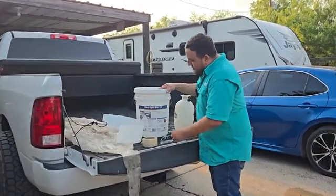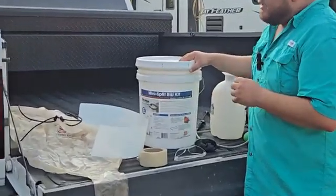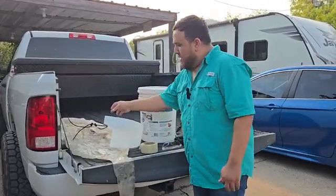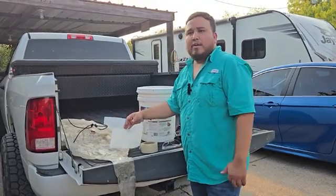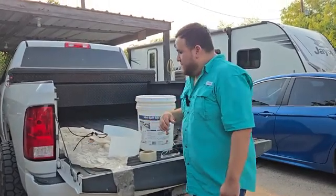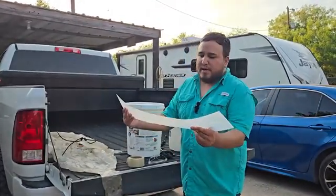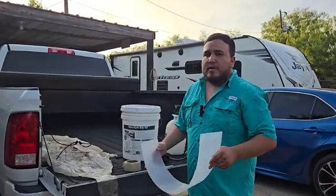One of the things we're going to use is called a mini split bib kit. The mini split bib kit comes with this bib right here. I'm going to show you guys how to install that bib. What the bib is going to do is go right underneath the indoor system and catch all the water and all that gunk and debris that's going to be coming out of that indoor coil and the blower itself. What also comes with this kit is this deflector, which goes right underneath the mini split and forces water into the bib itself.